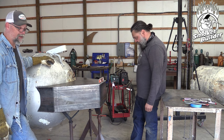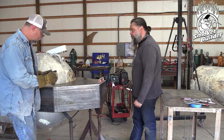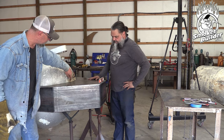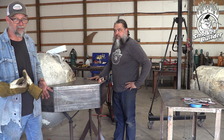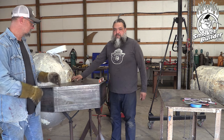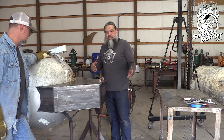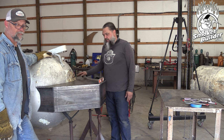We're at 0.07 — we're still dead on. Our stands haven't moved at all. We did drop this down, so now this mark I made earlier is not right. What we're going to do is mark it a different way so we don't get confused — we're going to use a scribe, which will put a little groove in the metal. So even after we pull this off and grind over it, hopefully it'll still be there and you can kind of see where it should be.